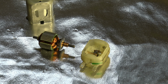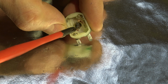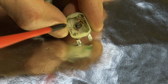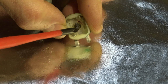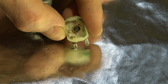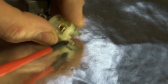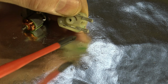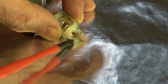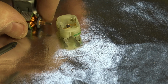Okay, and now we have gone through all of these areas. And the first one was really these coils, these movable parts and these inner metallic small areas in this center area. There is a coil, these parts burn out, this is issue number one. And then the second one is this white corrosion. In here we can see a little bit of this white corrosion in that area. And we have to clean all of this corrosion away. And this corrosion is the second thing.